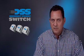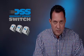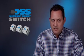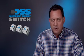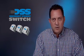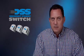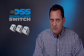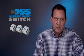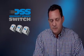I'm here to tell you about a new revolutionary way to power your mini-split air conditioning systems during power outages. What most people don't really understand is how efficient mini-splits really are. A 1-ton unit running on 120 volt only draws 3 to 4 amps on normal use. The larger multi-zone units are also incredibly efficient, so they're very easy to run on almost any generator, depending on your unit, 110 volt or 240 volt, respectively.